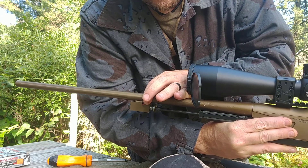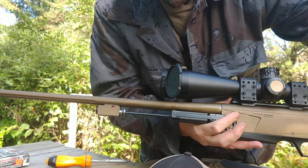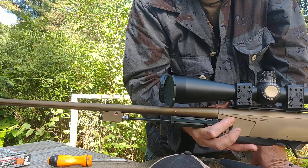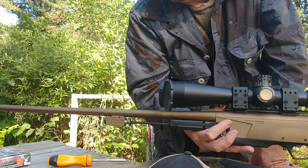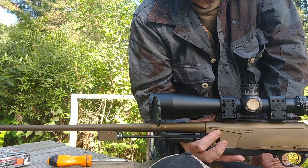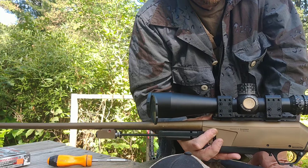On the other side is a set screw. You need to loosen this side up first, then adjust the screw on the other side. At three full turns backed off from being bottomed out, it ejected everything. When I tightened the set screw back up and started fine-tuning, I got all my hand loads cycling perfectly. This is the first generation of BARs with a tunable gas block, and I'm impressed with how quickly the frustration went away.